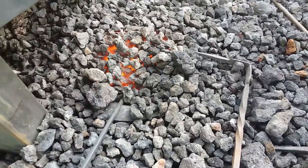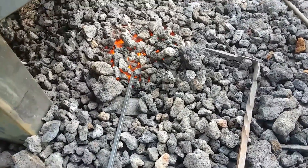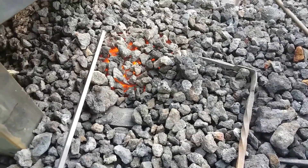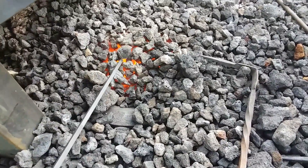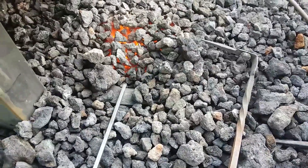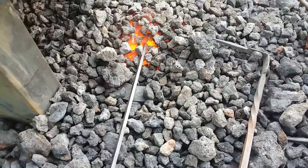The middle zone is a neutral zone where nothing much happens, and then the zone above that is a carburizing layer where a little bit of carbon and a lot of impurities are going to get added to your material. If you sit even with this rim and just shove it straight in, that usually hits you in the neutral spot.